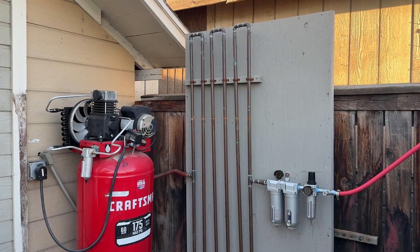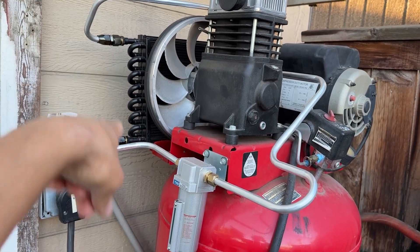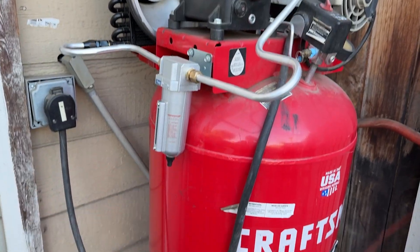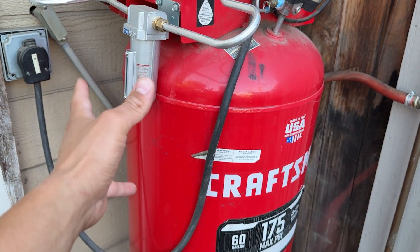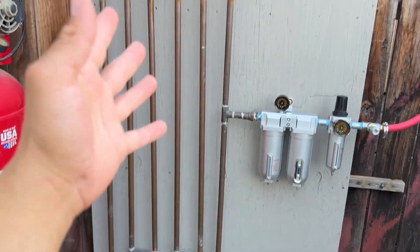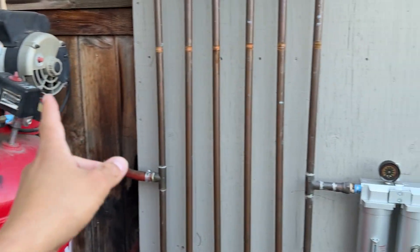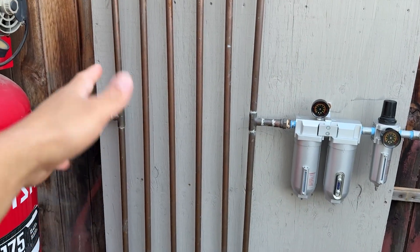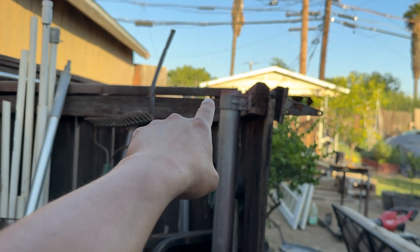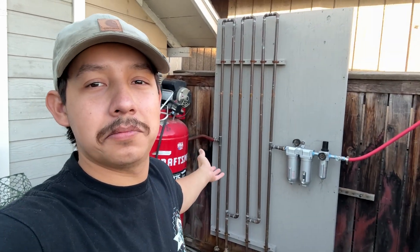Check this out — this is all done. I have the cooler right here and there's a huge temperature difference between the inlet and outlet, so that hot air is getting significantly cooled. This causes condensation and all the water gets trapped in the separator. After about five minutes of running you could already see a puddle of water dripping from this thing — it's working very well. We also have the passive copper cooler still in line for extra cooling, plus the separators, with a tube running all the way to the carport outlet.